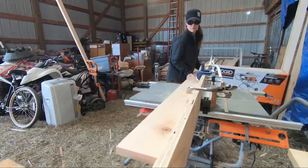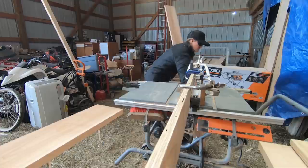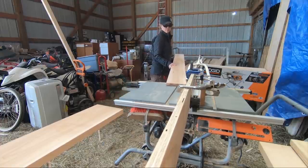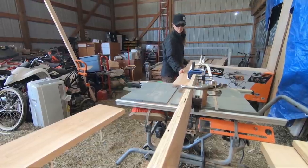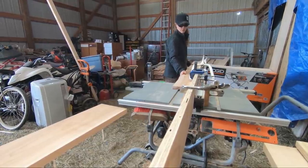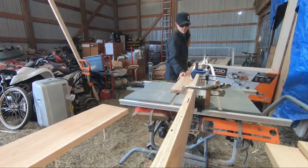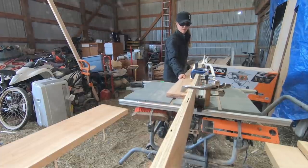And well, it's not smooth. Traditional dado face plates that you would buy would be plastic or metal, and they'd be very smooth. But with chipboard, it grabs the wood and holds it, so it creates a lot of drag on the board. Over time, we're able to wear it smooth for the most part, but until then, the first several boards are really hard to push through.